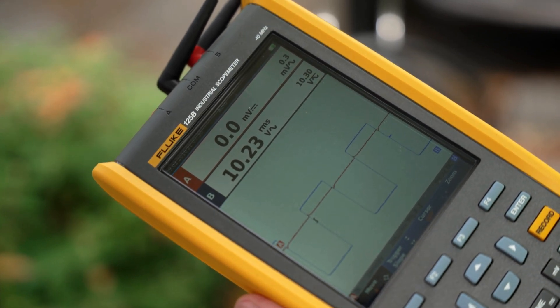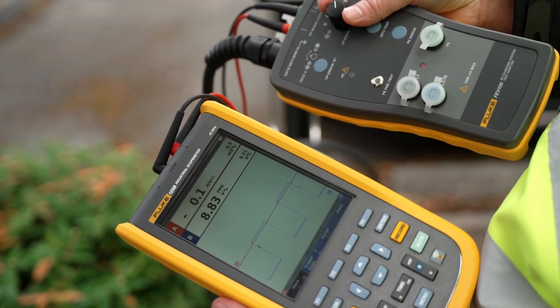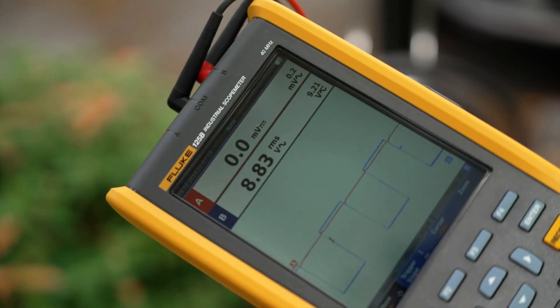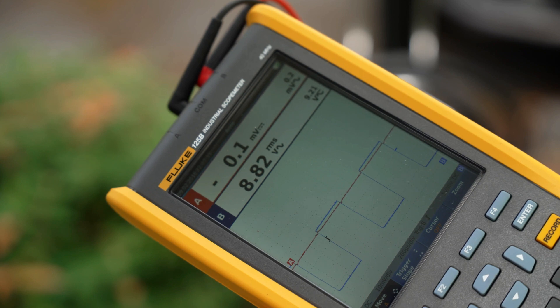Check the charging modes and duty cycle. Then return the CP switch to position C. The signal can now be visualized at its frequency. The charging station manual should provide voltage levels and frequencies of the different control pilot states.